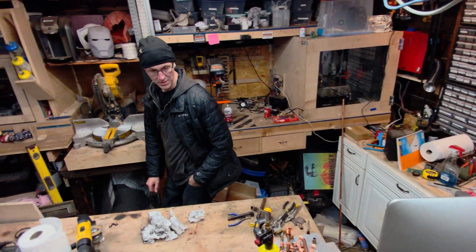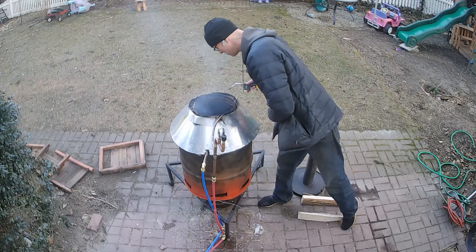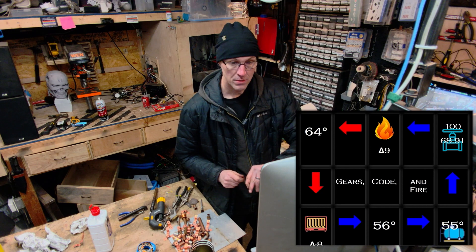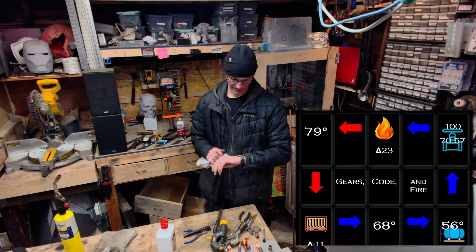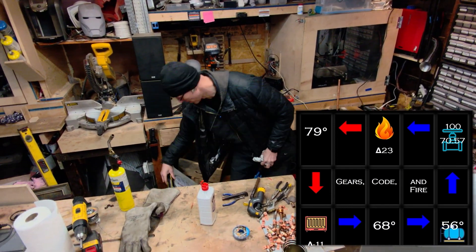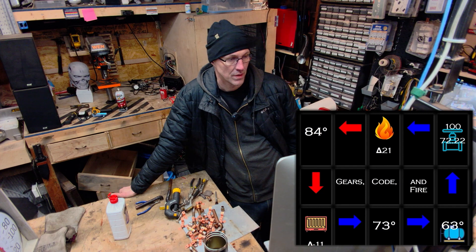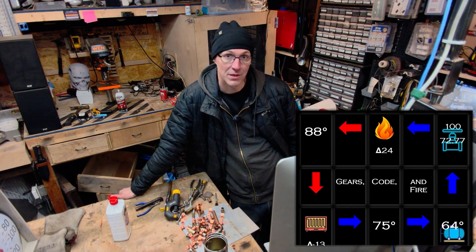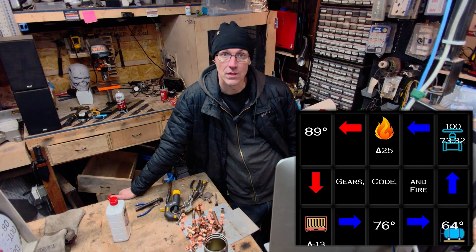Let's start a fire. I started with something fairly humble and controllable. Mission timer. We're two minutes in. Starting conditions: outside it's a chilly 19 degrees Fahrenheit. In the shop it's 35 degrees. Eventually there'll be a surge in heat. The water coming out of the fire is now up to 87°F - it's increasing 24 degrees every time it goes through the fire. And then when it goes through the radiator, it comes down to 75°F - the temperature is decreasing by 13 degrees.